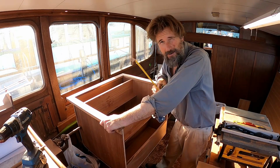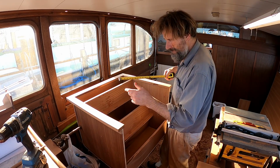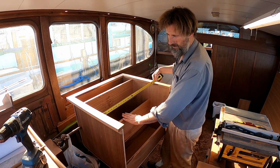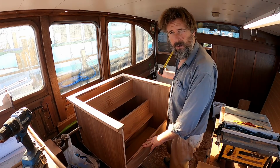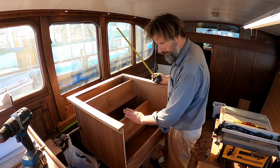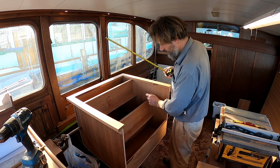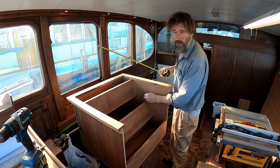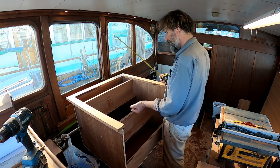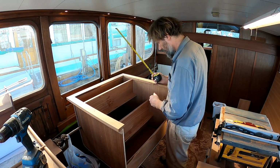I barely do. All right, for those of you who are actually interested in this, I've changed my mind. This step could have been 2 3/4 almost. The bottom step can only be 2 1/4. So instead of having 3 different width steps, I'm actually going to make both the lower trimmed steps 2 1/4. That gives me the other advantage in that I have significantly larger little side blocks here. Why did they have to be microscopic? There's no harm of this coming up. I just have to be able to reach in and get whatever it is I store down there.